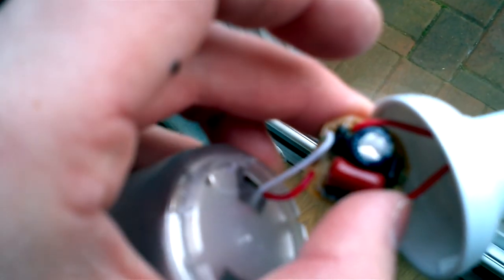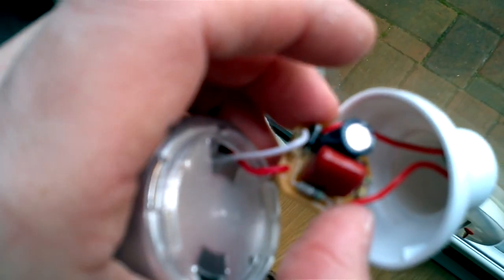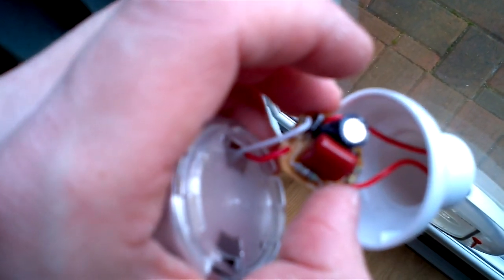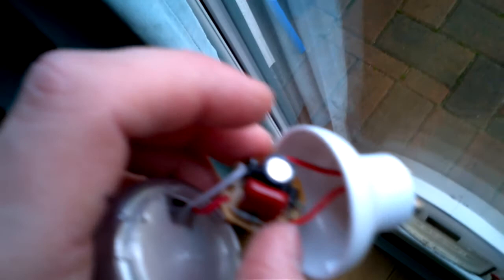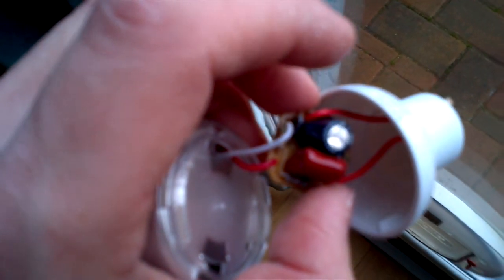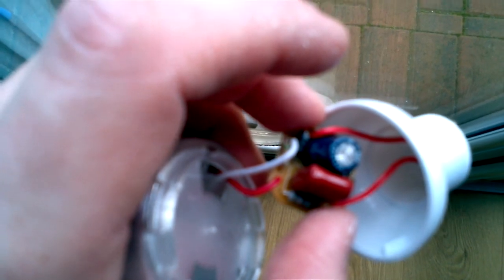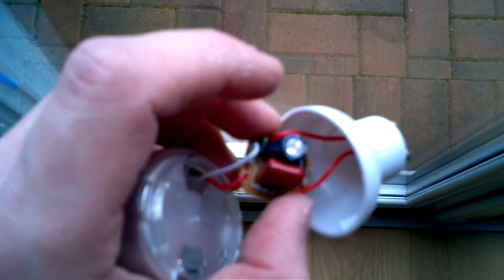But they are current rectifiers, or basically big chunky diodes that don't allow current to run in the opposite direction to what it should. With a configuration of 4 of those, you can basically turn AC current into DC current. The problem is that AC current doesn't switch immediately from 240 positive to 240 negative, or 220 these days. It's a sinusoidal wave. Even the cat's complaining about these things. And what that means is that instead of those current rectifiers on their own giving you a smooth DC output, it will give you a lumpy DC output.